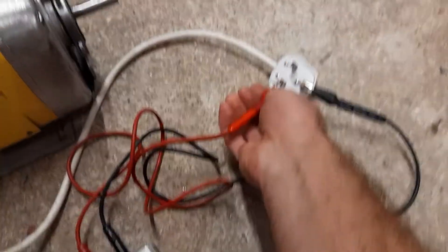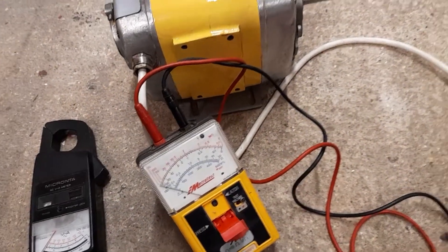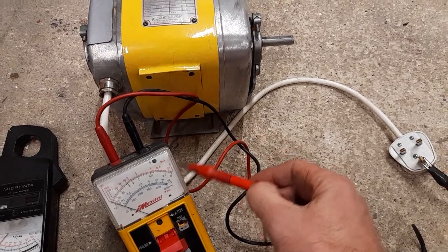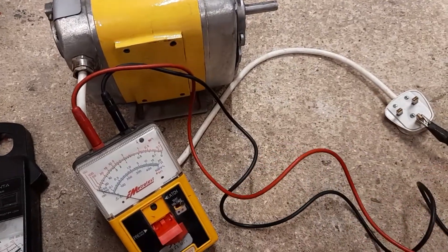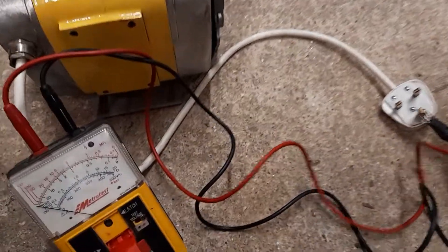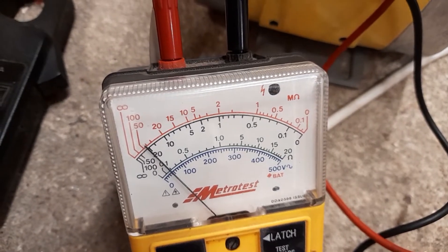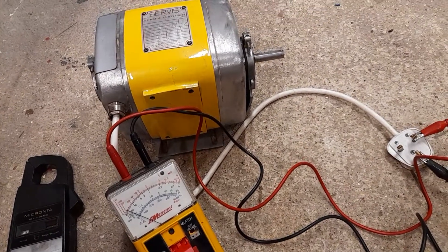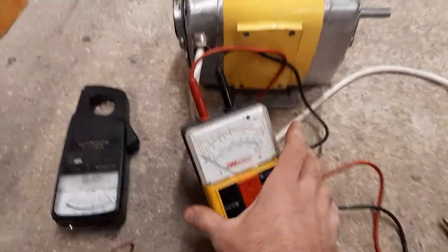That was on one pin — let's go for the other one. Let me just turn the tester back on so you can see it. If I check like this you'll see we've got a very very low resistance — it indicates something like zero, but of course it can't be zero ohms. That's the resistance between live and neutral. Now, just making sure I don't short myself out across these probes because it does give a nasty bite — there's 1000 volts after all. Once again it is more than 30 megaohms, it might even be 40 megaohms. This is an uncalibrated meter of course, so if you were getting paid for this you wouldn't be using an uncalibrated meter, but I believe it's good.